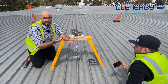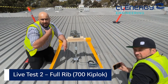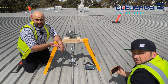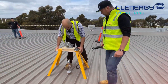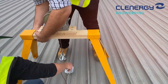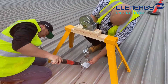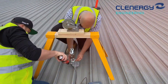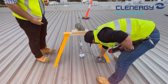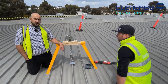Being that it only got to about 1 kilonewton, it's likely from our testing something like a full clip lock 700. We'll now use the correlated testing values to perform the assessment and give you a fixing capacity assessment. The first one was for a lap rib — this is a full rib, so you'll likely get higher results on a full rib.